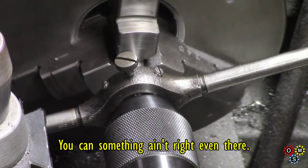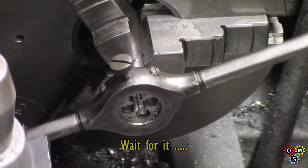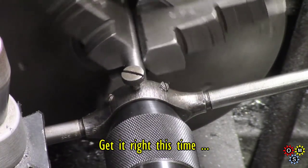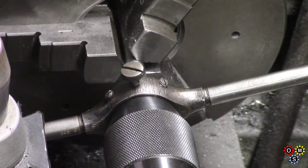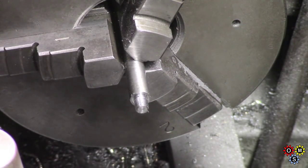Again, turn the spindle by hand. Just try again — and then we'll just get the thread on this one. As I said, the other end's done. Handling spindle as usual, and we should be far enough on there. All I've got to do now is to take this pin out and cut it off and put a chamfer on each end. And that's about as much I want to do on the lathe until I can give it some attention — it's a motor and pulley problem somehow or other.